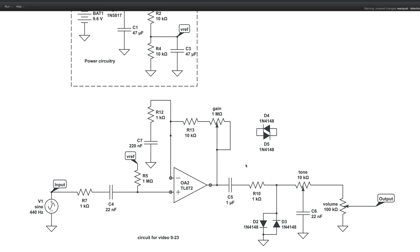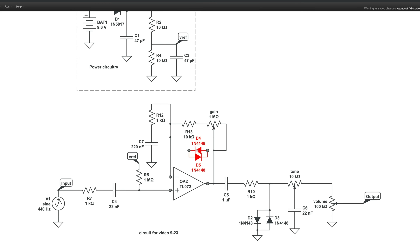That's the basic circuit of this first distortion circuit. Something else we did too - we did hard clip it, but we also had that switch that put the diodes in between the in and out pins of the op amp, like so. And when you do the switching, you get rid of those diodes, and that's your soft clipping arrangement. So that'd be your typical overdrive type of circuit there - basic overdrive circuit right there.